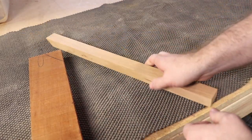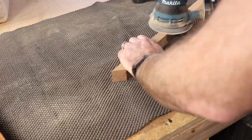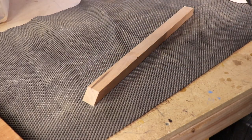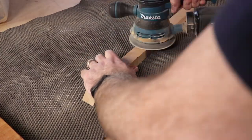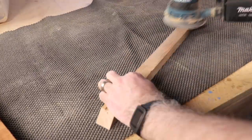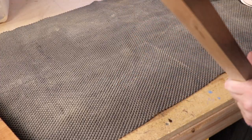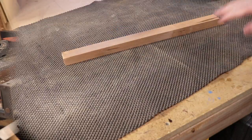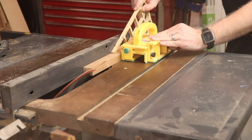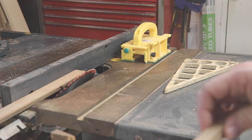Just because that's what we have throughout the house, so let's sand this up and see how it goes. That was 80 grit, we'll go to 120 and then 220 and hopefully get that super smooth. That is smooth as a baby's butt! I'll cut the corner triangle off right there and we'll get a name on there. I'm just kind of eyeballing this, so wish me luck — alright, that should work.